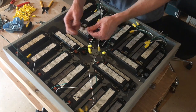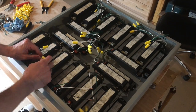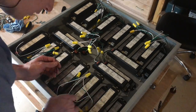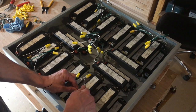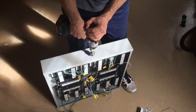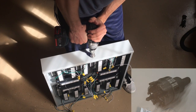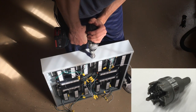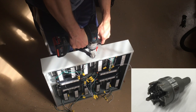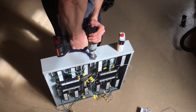Now I just need to connect all the wires so that all 30 of them come together and are powered by just one set of wires coming into the box. And I need to drill a hole in the side so that I can get power in. This was a pretty hefty carbide-tipped bit — it still took a while to cut through the steel, probably about 3/32 inches thick. I took it slow, used the high torque setting on the drill and lots of oil, and it worked out.